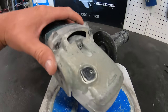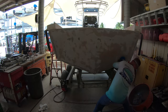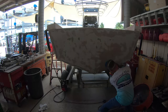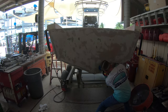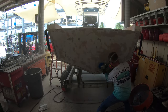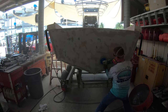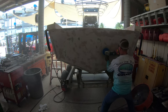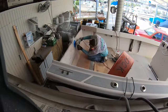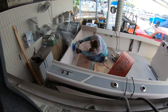We'll take the whirly board and grind down the outside and the inside of the transom, moving around in a sweeping motion. This exposes all the low spots, which will appear as a darker pink color, and knocks down the high spots, which will expose the fiberglass. Once we get all these spots exposed, we can take a large trowel and fill in all the low spots to help smooth out the transom. This process takes a lot of time and practice, and I'm not the best example, but you can get the gist of what to do and what not to do.